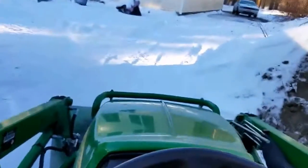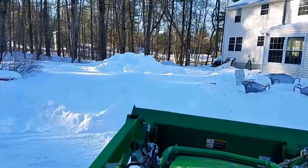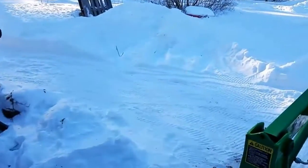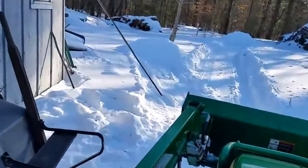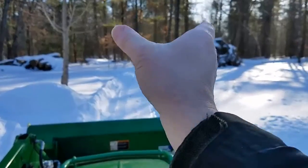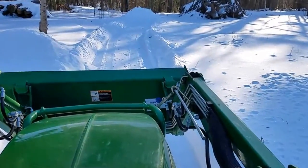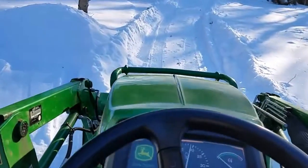A little bit quieter once you're outside the shed. We can lift this up. I already did some pushing with snow the other day — we had over a foot of snow and I built a little bit of a snow pile there, cleared out the snow going up to it. I got a path here but I'm going to widen the path going towards the backyard. I kind of pushed it along a slot — I watched some videos on slot dozing and the idea is you just do it again and again in a slot so what you're pushing doesn't fall off to the sides, it stays ahead of the blade. In this case it's a bucket, but the technique works just the same — keep it level and then drop it down and do some pushing. Four-wheel drive is pretty much needed in this kind of weather.